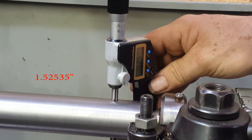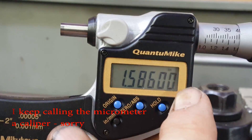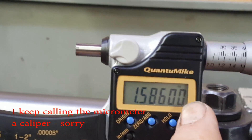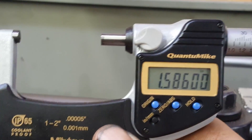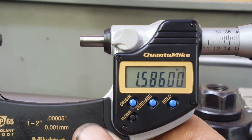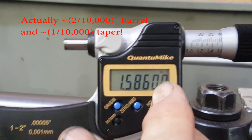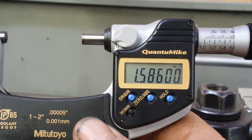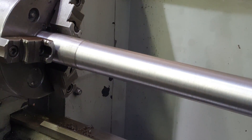Let's take a look at the caliper itself. It has decimal places out to — it'd be 10 millionths if it was a full digit, but it's actually either a zero or a five, so this caliper is a 50 millionths caliper. We got less than one ten-thousandths variation. The error was in that fourth position — in the ten-thousandths place, we had a couple of tenths difference along the length of this. It's really remarkable.